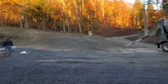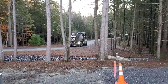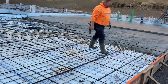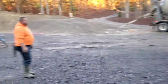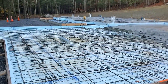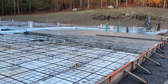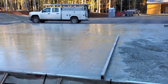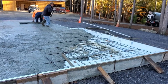So there's two trucks down, 21 yards right there - we're not quite halfway. Four trucks definitely I don't think it's going to do it. Pouring 10 inches thick, I mean it goes in pretty easy but a truck doesn't go very far. There's our fourth truck leaving - 40 yards. I think we got 41 and a half out of those four trucks. We got a little balance, already called it in so he's on the road, should be here shortly. Been nice having just five trucks. That little area is probably three or four yards - we got five coming so we'll be all good. Have this in and then tomorrow we got this space here, a big patio out back - those are both stamped concrete we're doing tomorrow. Then this whole project will be done for us.